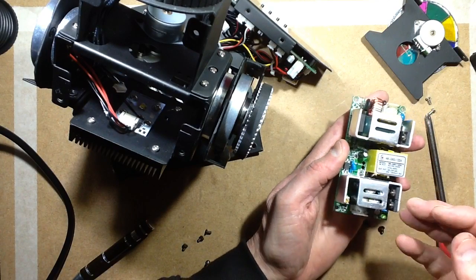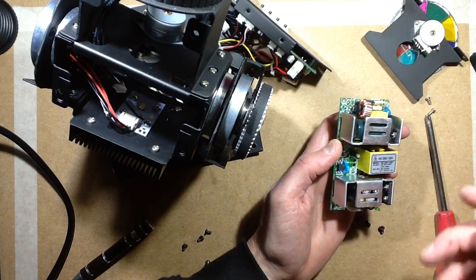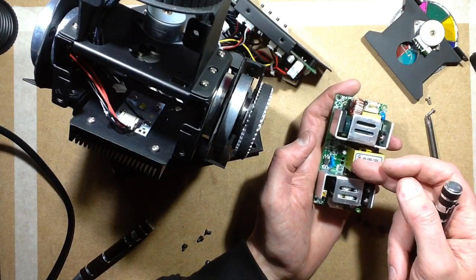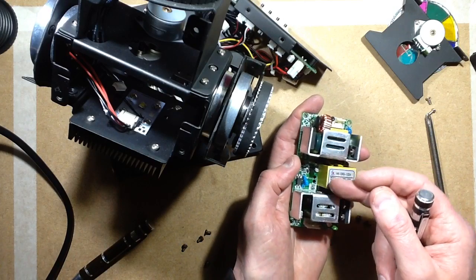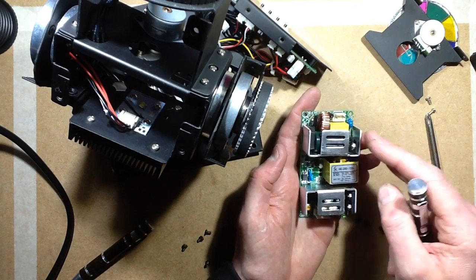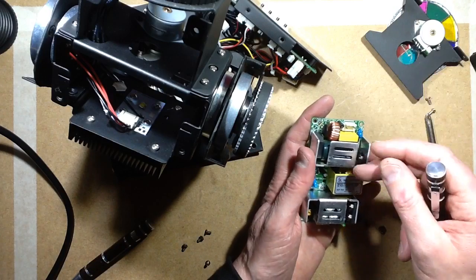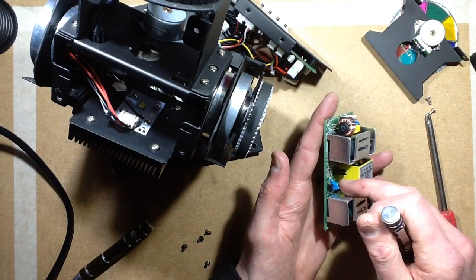When you've got a high frequency switching power supply, the transformer, although it's designed to couple across inductively, also couples across capacitively because it's running at very high frequency. Though there's a very low capacitance between the primary and secondary windings, it's still enough to transfer a modest amount of current across. And without any easy path for that to return, it tends to find routes along other cables, and it can cause radio interference. Any wiring attached acts like an antenna for the high frequency switching noise. So that's why they put this little capacitor here.